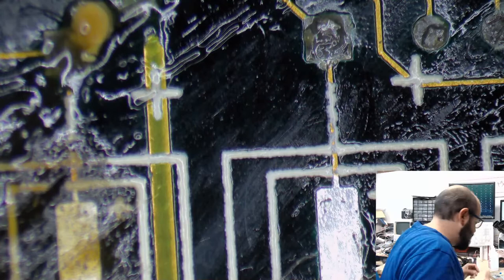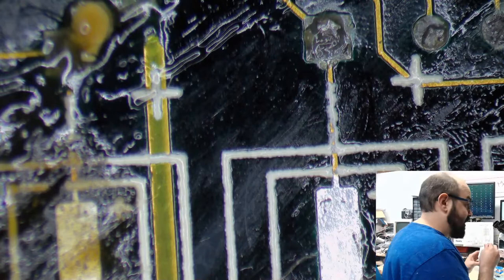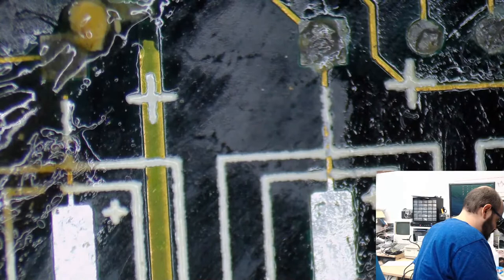Well, the clamshells, I would actually say that the power adapter is the same as the PowerBook G3, and that was the barrel that Apple used for a while. Now, I have not been searching for one on eBay for quite some time. I have no need to because I have a few spares. But they are not as uncommon. You just have to know what you're searching for. Any PowerBook 45-watt barrel that fits the clamshell iBook should work fine with the clamshell iBook. I've not had any problems with that.